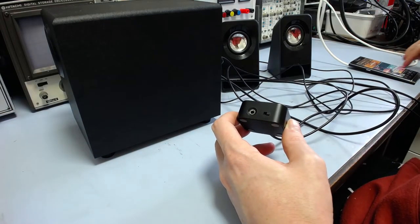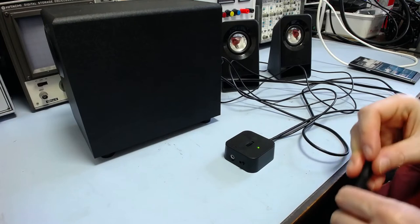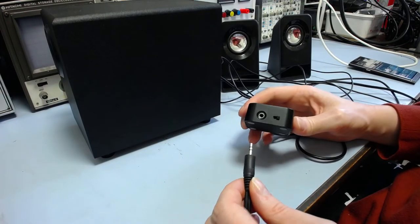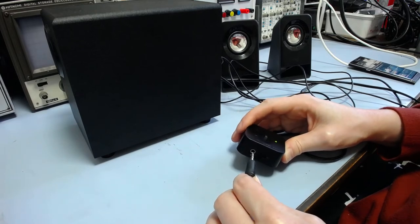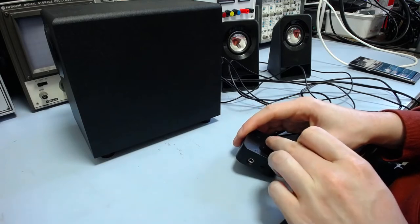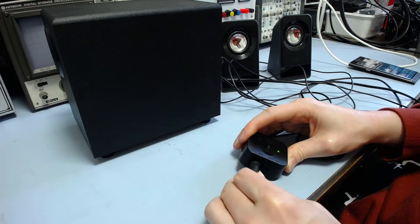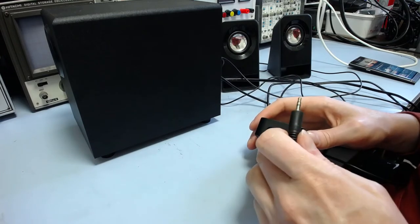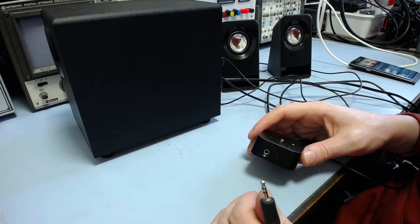I also would wonder if possibly the headphone jack itself. Oh, this is not actually playing anything, it's just being silly. I'm just going to try plugging a cable in. This has got nothing connected to the other end of it, into here, and just see. Yeah, listen to that. I don't think it's obvious that this is picking it up, but when I first plugged this in here, and pulled it out again, for a moment the audio didn't come back straight away.